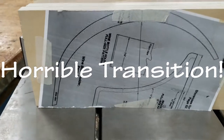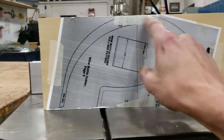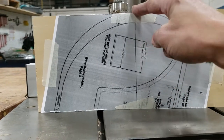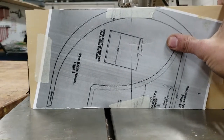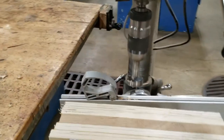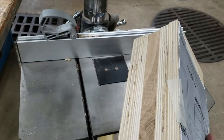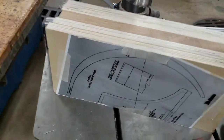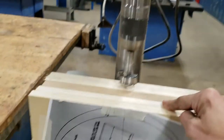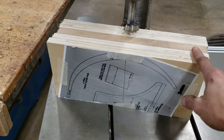With my new big wide blank, I have just enough space for this curve to fit while maintaining my line perfectly perpendicular, so when I drill it I don't have to have the table all wonky. Before I drill my hole, I made this edge nice and flat and that edge nice and flat. I want it to sit flat on the drill press, and when the drill bit's cutting I don't want any problems — so I put those sides through the jointer.